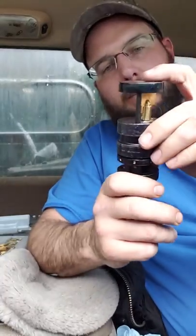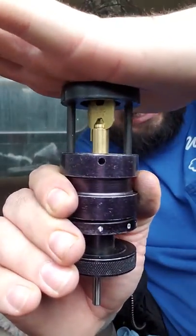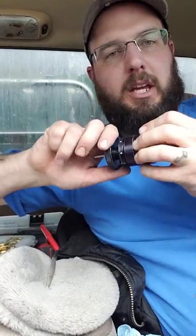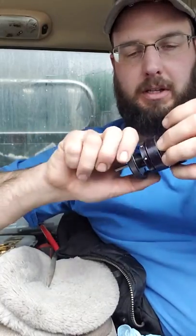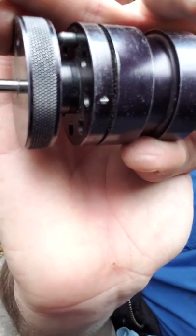So you can see the cutter come up. There should be no space. You're putting pressure down, holding the key in place, like so. Okay, you have to hold the key down. So that's why there's this little finger groove here. So you can grab it like so, and then you're twisting this way. Think of it like grinding a pepper grinder. It cuts, you can go back and forth, but you need to go until there is no more room in here. There is absolutely no more room. Okay?